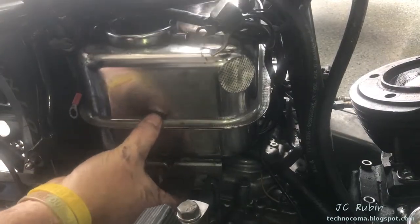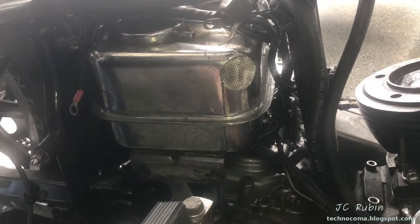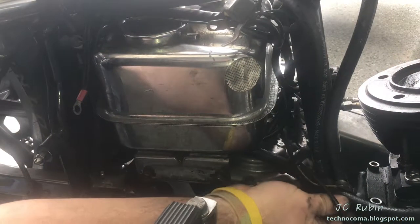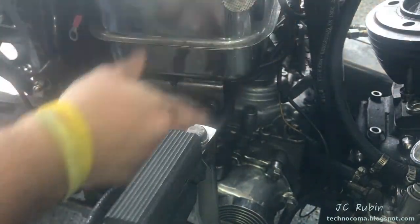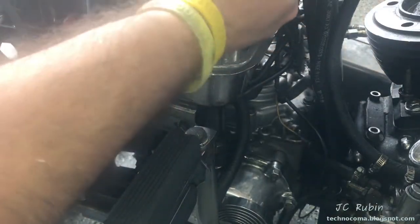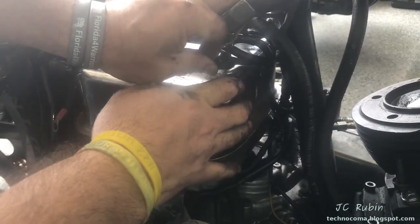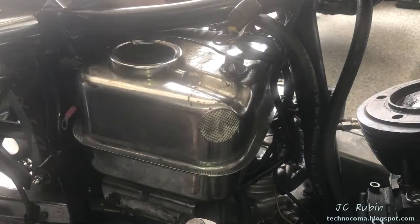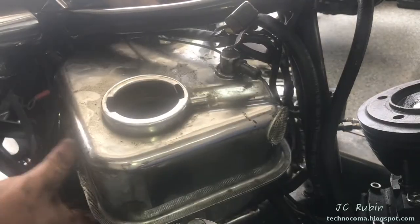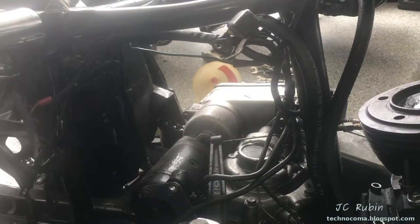The tank is now forward. I still need to remove the neutral signal right there. This hose is disconnected — pull the hose under to get it into an optimal position. Making sure the cables don't bind. I can see this hose wraps around so I have to pull it that way. I've twisted the tank so the hose falls around back — give it another turn. There we go, the oil tank is removed from the bike.